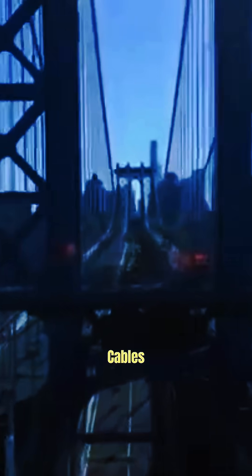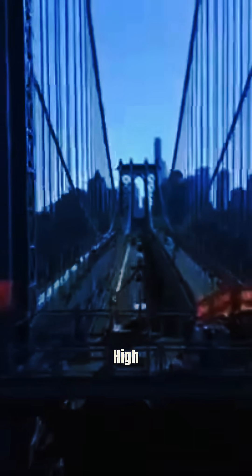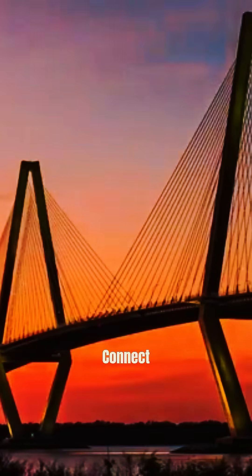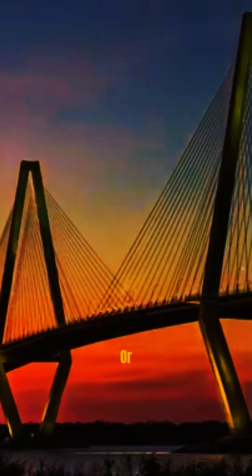The next step is to place the bridge structure on the pillars. The bridge is supported by several different means, including cables, which consist of a bundle of high-strength steel wires surrounded by a layer of polyethylene. These are fixed to the bridge's pillars with a specific system so that they connect the bridge's body to its pillars or towers.